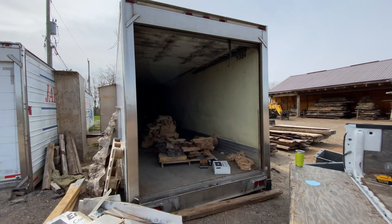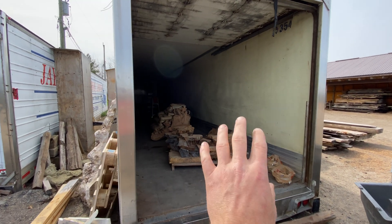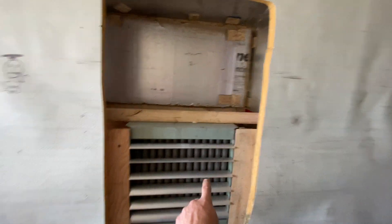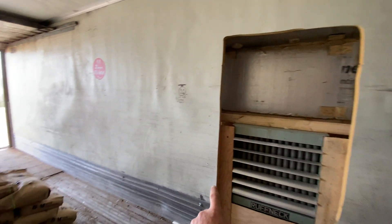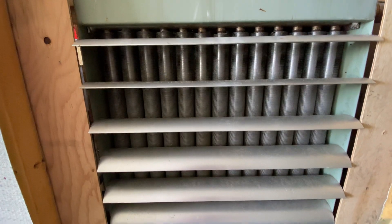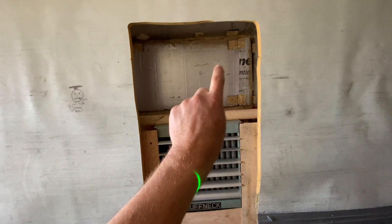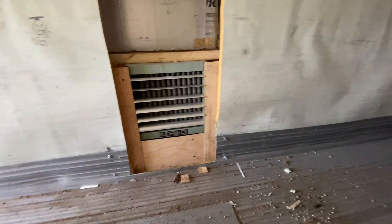So these will still operate almost the same, the difference being this is 53 feet. We have the same kind of pull-down door. This was also a truck body, insulated. They had this hole already cut out, which was pretty convenient because it literally fit this rad — we just had to add in these wooden plates. It's got hot water flowing through a radiator. You can see all the coils in there and on the backside there's a fan. Hot water flows through it, the fan blows the air, sucking in air here, coming around behind, back through the fan, and finally going through all the wood packs.